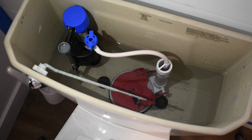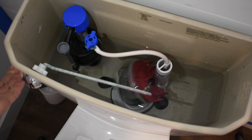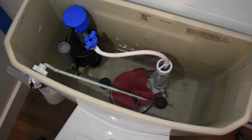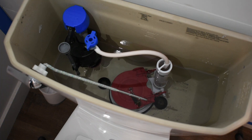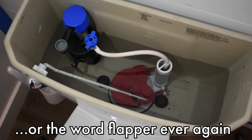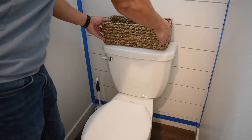Because if so, you may have a bigger problem. Once the tank is completely filled, do a test flush and watch to make sure the flapper closes appropriately and everything looks fine. The tank starts to refill, and once it is filled, you shouldn't hear any more leaking, trickle, or the tank refilling itself randomly throughout the day. Once you're satisfied, put the tank lid back on along with anything else that was on the toilet, and now you're done.